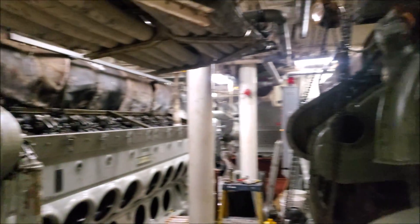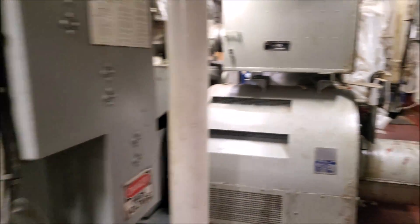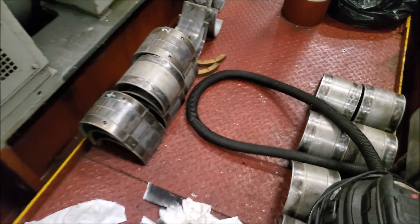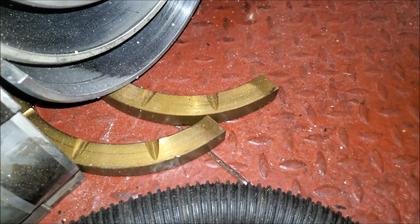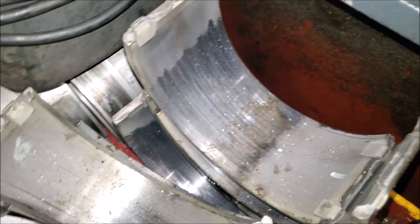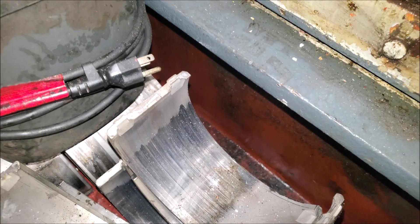Air intake for the 12, and there's a 16 there. Another 12 cylinder, pretty much together. And a big 16 here. So here are the main and the connecting rod bearings — here are some main bearings, a worn connecting rod bearing, and then thrust bearings down there. These are all old. They're scored but these are still serviceable — it's not like the engine was going to blow up on these. But these engines are taken care of really well, so it's being overhauled.